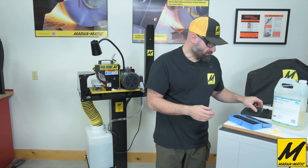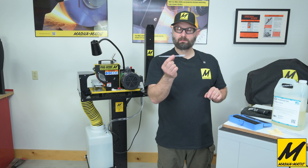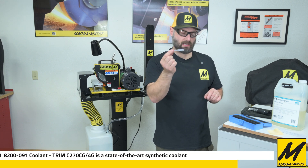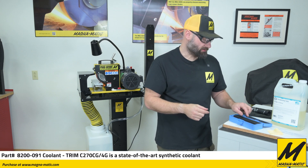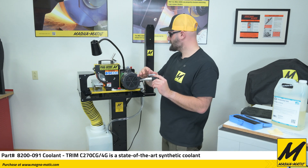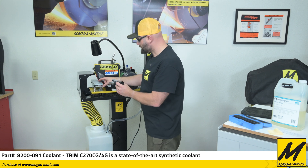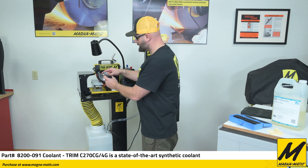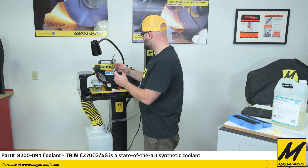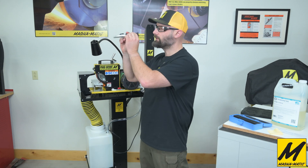To put the coolant on the slide itself, the little kit has a pipette if you'd like to use that. It's also perfectly fine to use your finger and get a little bit of the coolant. We'll open up the slide, turn the coolant pump on — there's plenty running over the work table — dab a finger in there and put some on the slide, then turn off the pump and have a quick look.